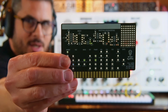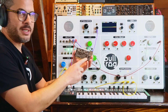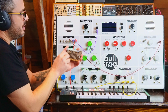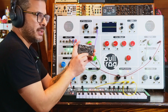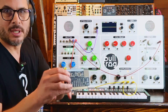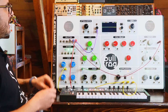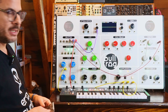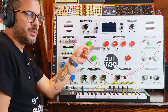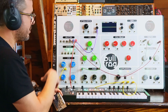As you can see, these cards have exactly the same connections that you get on the front panel of the Bullfrog. The way that you create your presets with it is simply by replicating the connections. So you create a patch that you like, and then you solder wires to mimic and replicate the exact same connections that you've made on the front panel. Once you've done that, you can put a title up here, and then simply insert the card in the slot on top of the Bullfrog XL, and it'll make all those connections for you — so you don't have to make them again. It's a way to have a little library of presets that you like that you can go back to and reuse. Of course, it won't save your knob positions and switches and stuff — you have to do that manually.